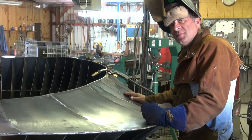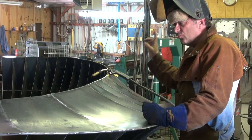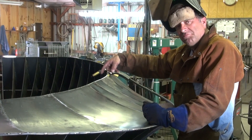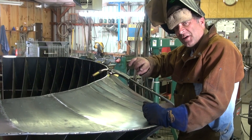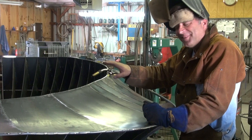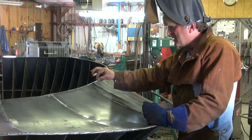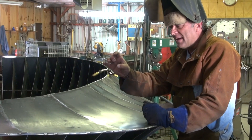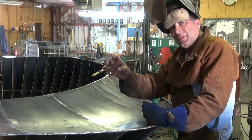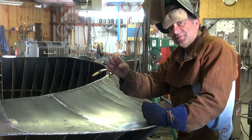What can the pulse do that you couldn't just do with a regular MIG welder? Well, the pulse is just that — it takes the welding arc and turns it on, turns it off, really really fast. What it does is it allows you to have the right voltage, so you've got the right heat, the right penetration going on, but it only does it for a fraction of a second instead of continuously.